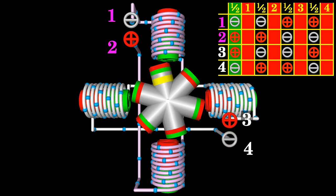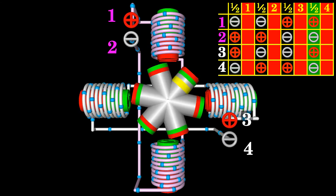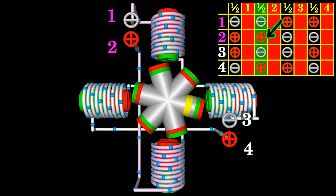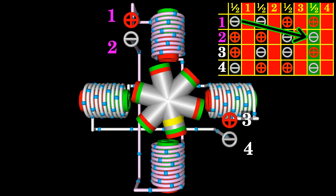When deleting the columns with just one phase on in the table, this stepper motor still rotates clockwise when going from right to left through the command sequence. This operating mode of a stepper motor is called two phase on full step excitation. In that mode, both phases are always on, and from one step to another the polarity of one of the phases is changed. The rotational movement is 30 degrees per step, which is equal to the normal full step mode. The advantage of keeping both phases enabled is the higher torque produced by all four electromagnets during motor operation. The disadvantage is the doubled current flowing through the motor compared to the single phase full step mode.